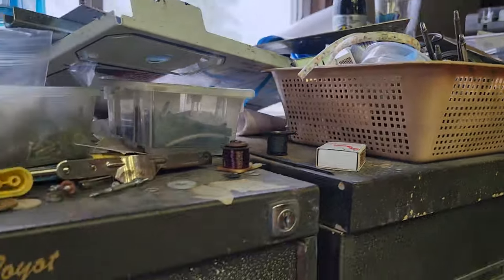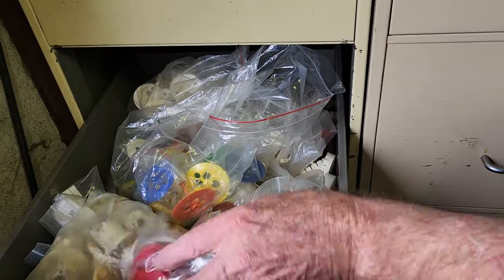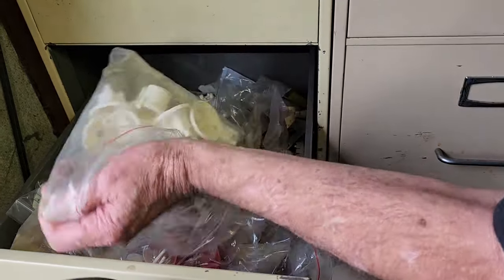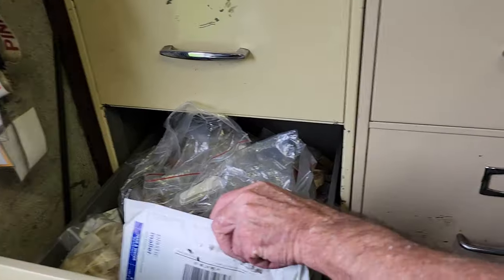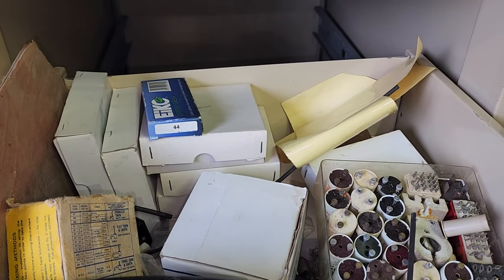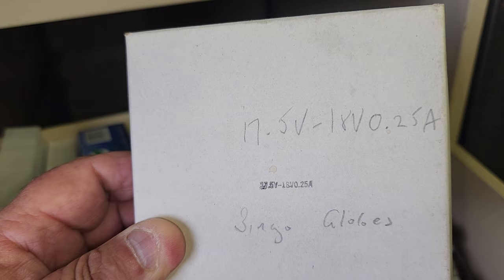Let's open this drawer. This is our rubber chauffeur — a holder for plastic bags that we go through a lot. Here's more brand new little parts like skirts, bumper bodies, more bumper bodies, flipper bats, lane guides. We just bought about 20 Gottlieb flipper bats. We've got braid for the steppers. In here we've got light globes — mainly #47s but we've also got some bingo globes and flashers. Some of those bingo globes, particularly the ones in the back box with a moving number, are 17½ volt — you can't put #44s or anything else in there.